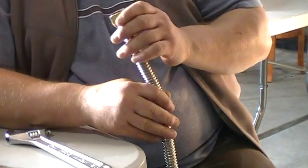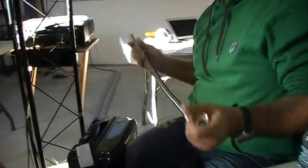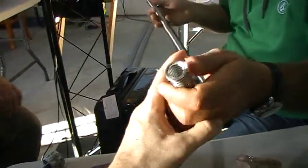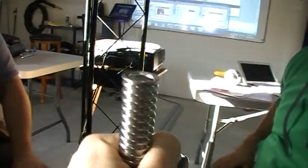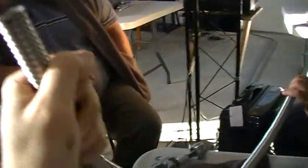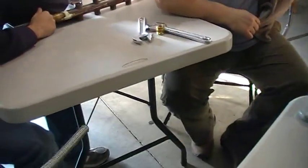It was a piece of this ring. It doesn't matter — this ring can break. The ring is only important to hold it in place for the moment. We actually made a nice flush seal, almost like the factory. Did you take the other piece of the ring out since half of it broke? I think it fell down. See if the other half is stuck in there, and then it might leak. Well, it won't because we're going to use a graphite washer. But when you torque it down, it's going to only push on half of the seal.